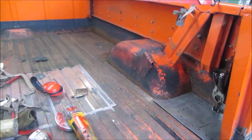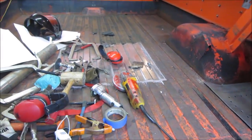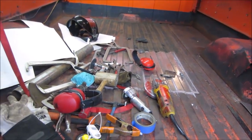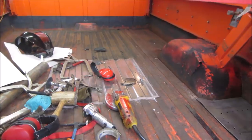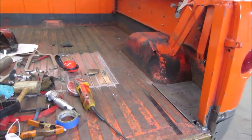So what I do after I paint is come back and use an oil mix to seal it from rusting any further. It's a New England truck. It definitely helps it out over the long run. And that's what I'll end up doing. So you're welcome to do whatever you want on your projects, but that's how I do it on mine. It's worked out quite well for me. Right, now I'm done, I guess.